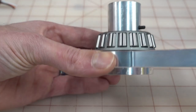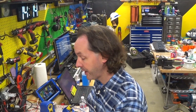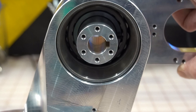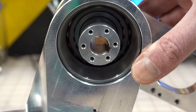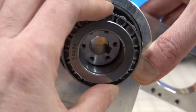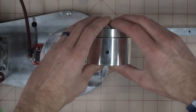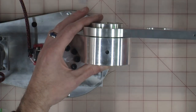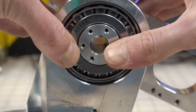As you may remember from before, we have the races — the outer rings of the bearings — already in here on both sides. With that in place on both sides, we can bring our arm in. I've waited so long to do this. It just drops right into position and our bearing here will seat right into its race inside. Then we take the other bearing — another 30206 — that goes in from this side, and they should face each other. Both drop into their races and now, instantly, everything is nice and snug right where it's supposed to be. It'll still fall apart if you let go, but we're on the path.